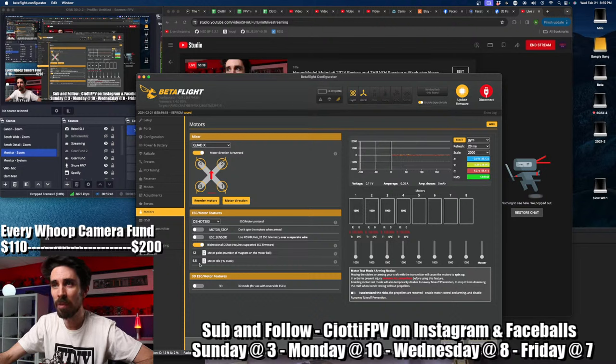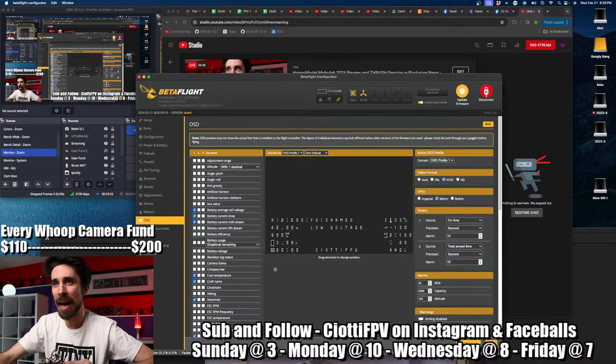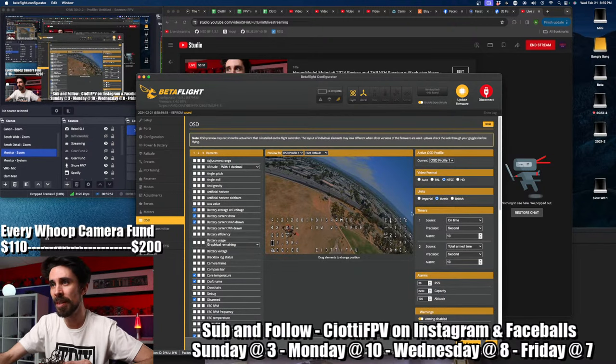12 motor poles, good. Bidirectional D-shot is turned on, fantastic. It's set up for props out. I like that. And now my OSD, I'm actually going to grab a diff off of one of my other Tiny Whoops. Wow, they've got a lot of OSD elements on here. Holy cow. I'd rather have too many than too few, though, so I don't hate that.